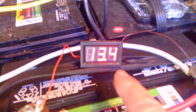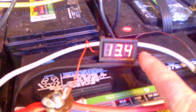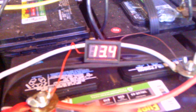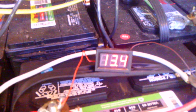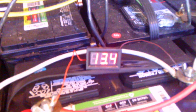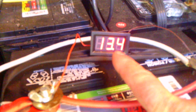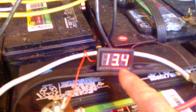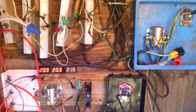That's the goal. When you're setting up solar panels the goal is to keep your batteries charged even while you're using the average amount of stuff you use every day — not everything, but the average load. You want to have enough solar panels and the right regulators so that when you're using most of the stuff your batteries stay charged. That gives you an extra charge for the night. That's just the way you really have to get it if you want to not have any problems.